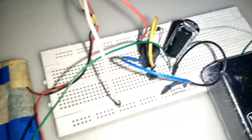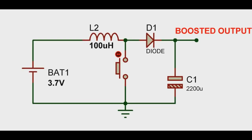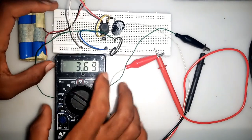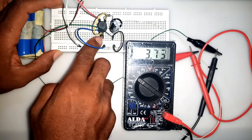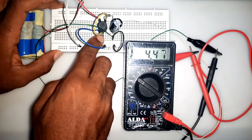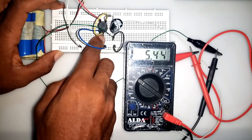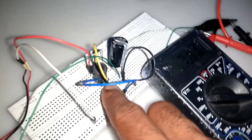Now, in this new setup, we connected the inductor in this configuration and once we provide a momentary voltage to the coil, the inductor builds up a magnetic field as the voltage increases. We are using a 3.7V lithium battery as the input and the output voltage is ever increasing, and this is simply the way boost converter circuits are developed.